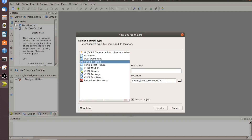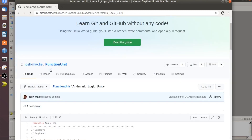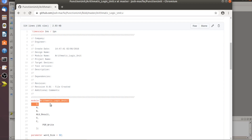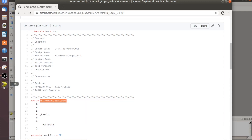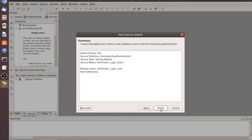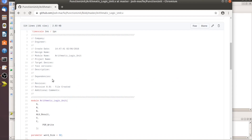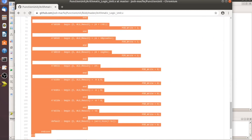With these names we've got to make sure it's the same name as the module we're selecting. I'll open up the GitHub link for the arithmetic logic unit and find the module name, which is 'arithmetic_logic_unit.' I'll right-click, copy that name, go back into ISE, paste it directly into the file name, hit Next, skip the inputs and outputs since those are in the file, and click Finish. Then we can copy all the code and paste it directly into that module.